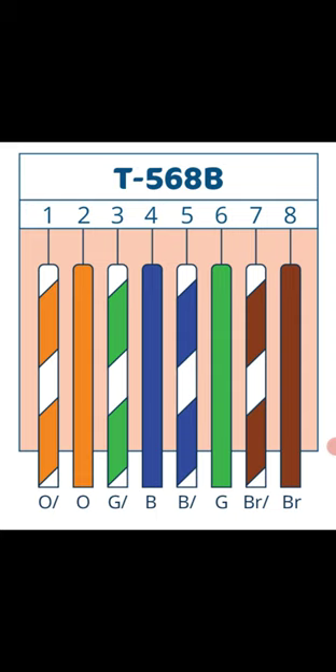Be careful about wires seven and eight if your device is PoE. And pins four and five — blue and white blue — are used for telephone, so if one of those wires is damaged, your telephone will not work.